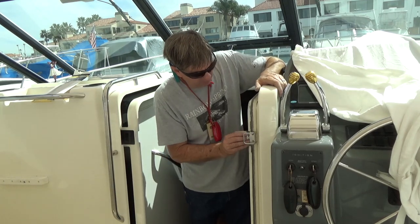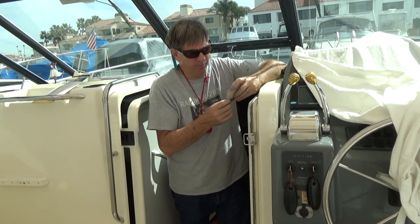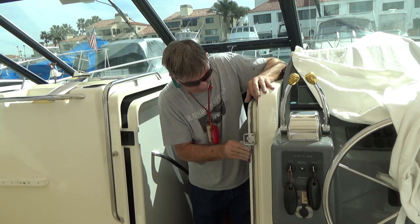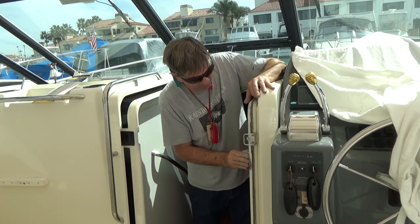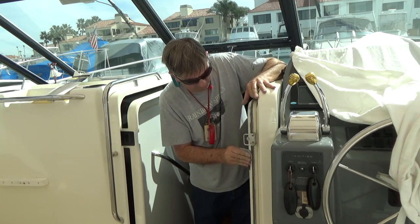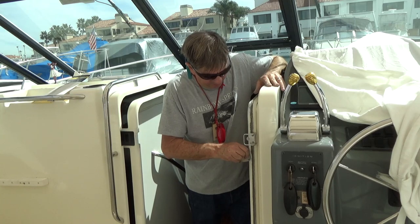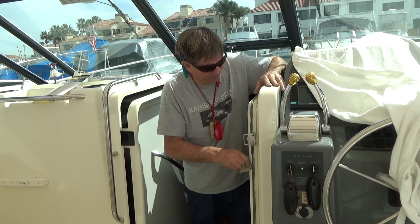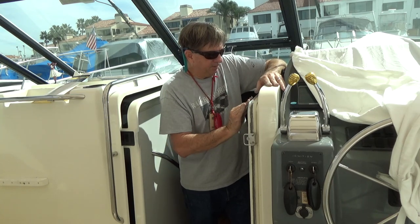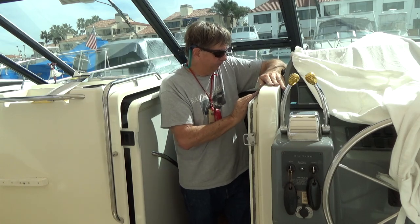Okay, I've got a little 120 here. It's actually drywall sandpaper, but it's really knocking this paint down really good. So I'm trying to get it so there's no lip in between the metal and the paint. I tried some 220 to start off with, but that didn't really do anything. But this drywall sandpaper is just taking it right down.